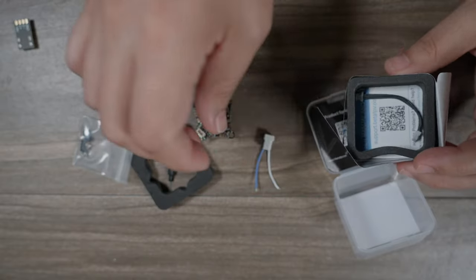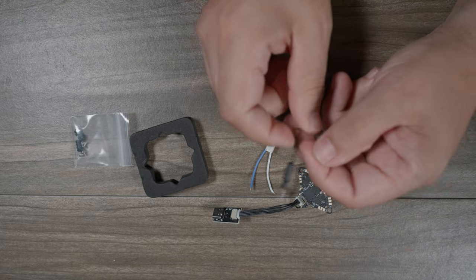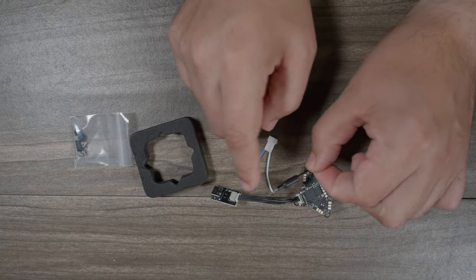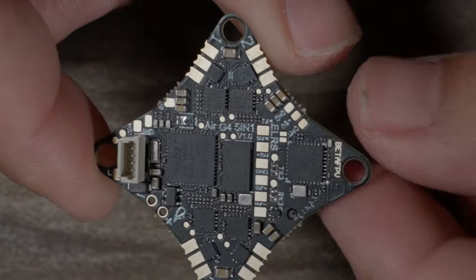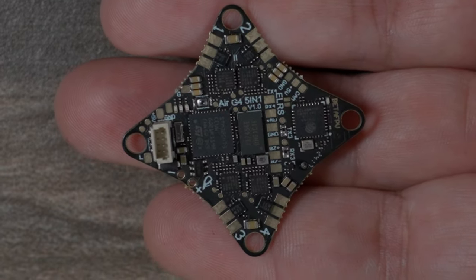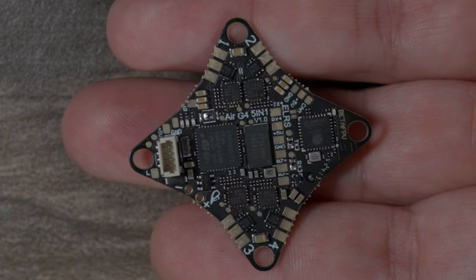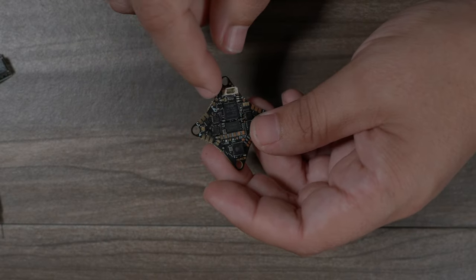In the package you have your BT-2 pigtail. It comes with your little dipole antenna — we're actually going to remove the shielding on this to save a little bit of weight. Of course, it has your gummies and screws. Check out the really nice pad layout on this thing. You're going to have four motor pads — actually large pads for a board this small — and then your power leads are going to be right here in the corner.